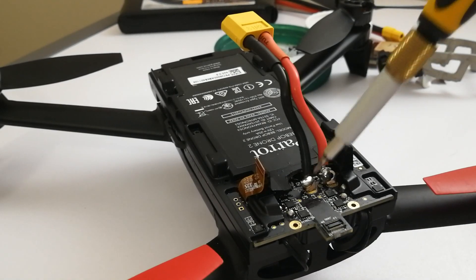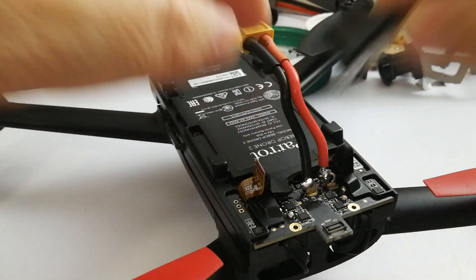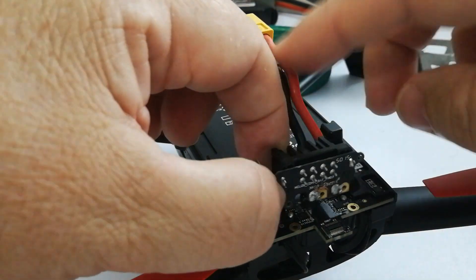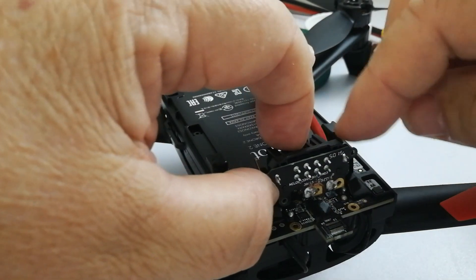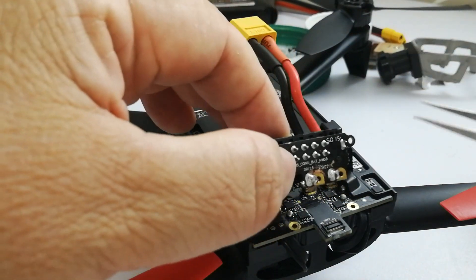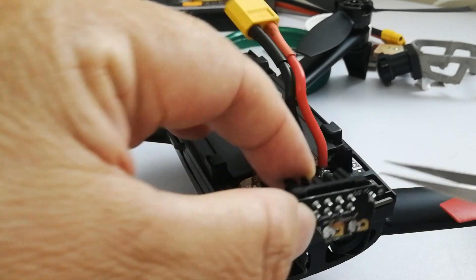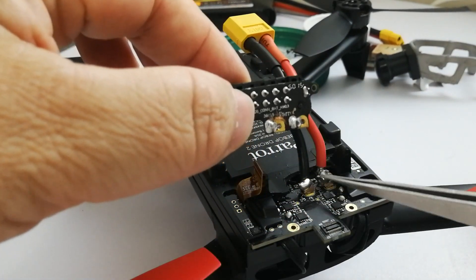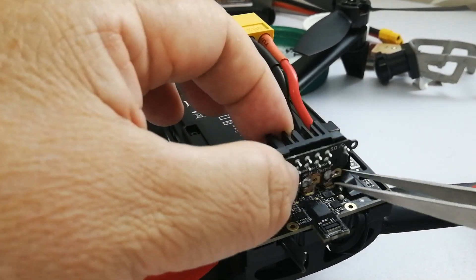So, of course, these two wires weren't here to begin with. What was here was the standard part which you probably recognise, that sits out the back, which your battery connects to. And that was basically bolted in there, attaching to these two poles here. So there were five screws to remove. And the last trick to removing it was heating these two pads here and pulling this thing forward. Once that solder released, you pull it forward. And the two pins — they're still actually there — they were coming through this board. So that's what this board actually mounted on and was soldered onto.